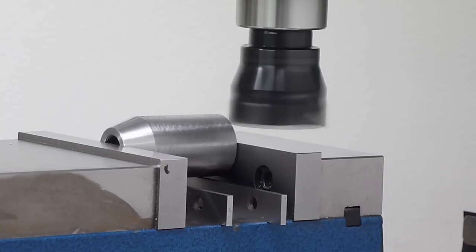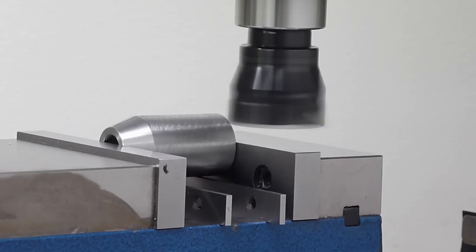Okay, we've got the brake on the mill. We're gonna mill off two parallel faces. Each depth is 125 thousandths, so 125 thousandths off each side. I'm gonna go 40 thousandths at a crack, and then 5 thousandths for the cleanup pass.